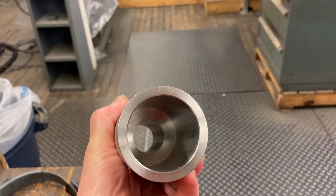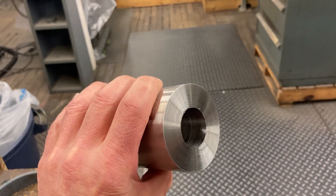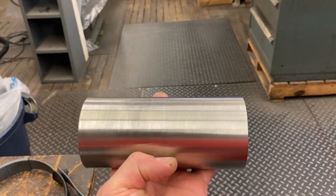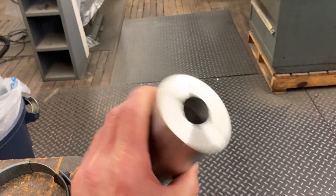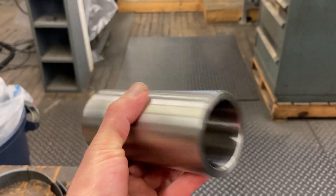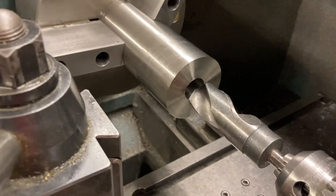So the sequence is: drill halfway through, rough bore, drill halfway through from the other side, rough bore, then finish bore all the way through. We're also going to skim cut the OD just so we've got a nice true surface so we can grab on again when we flip it around, indicate it, and make sure it's running nice and straight. That's the through hole right there — that's where we're at. We've got number two in the machine already.